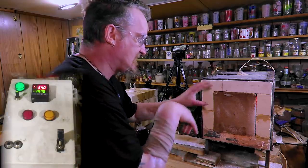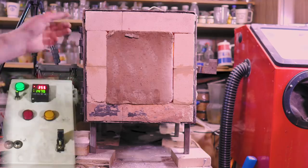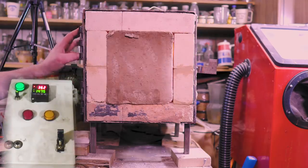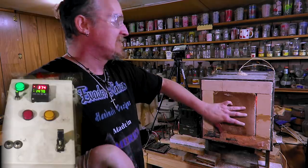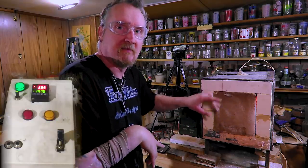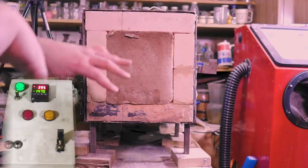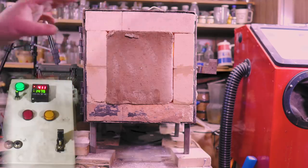So we're going to do a test of the big oven and the little oven. The little oven will come almost at the end of the video, but I just want to show the difference in how it's heating up and how fast it goes. So now I'm going to have to flip this door over. I took the door off because I need to flip it. I'll have to put this part here over here and put the hinges over here. I'll have to buy new hinges because I welded the hell out of these things and they're not coming off.